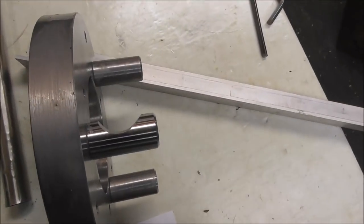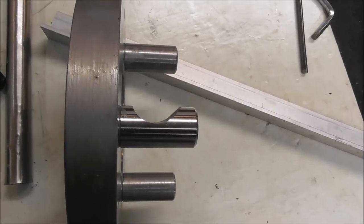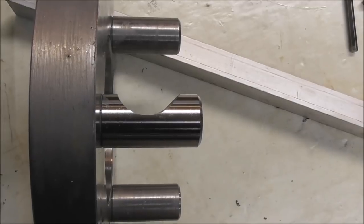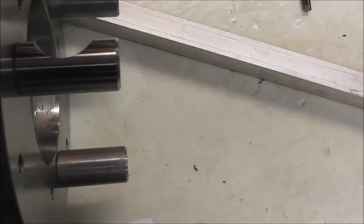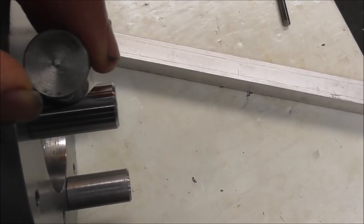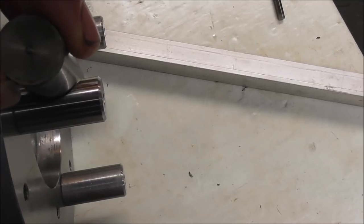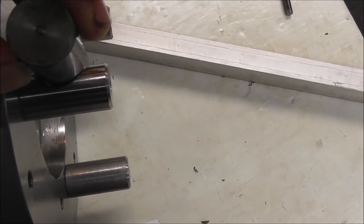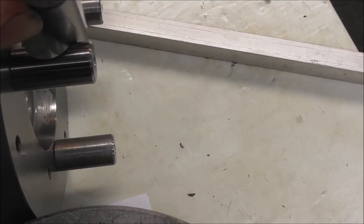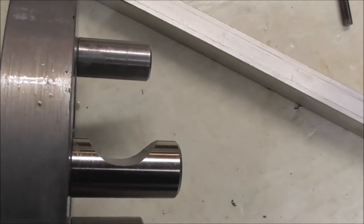Just to make that a bit more clear, so there's the cutout there. So you can see it's slightly slotted and it's got a 45 degree lead out for the cam action face. If I put a 3/4 inch dowel there, it's 4.2 millimeters back off that face in that direction. From memory, was it 6.2 deep? And then a millimeter slot in that direction, and then coming out in a series of steps to generate that 45 degree angle down there.